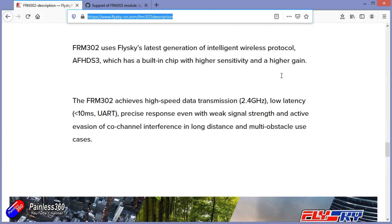Normally when talking about long range, things like Crossfire and others are typically using 915 or 868MHz — much lower frequencies — and those lower frequencies will propagate further on the same amount of power. So it's odd, potentially, to be talking about a longer range radio system running 2.4GHz.